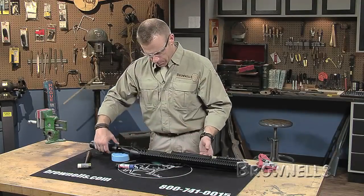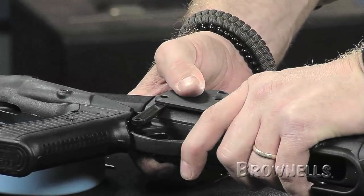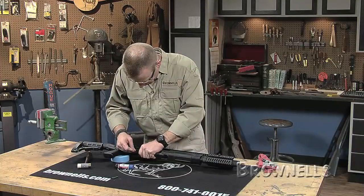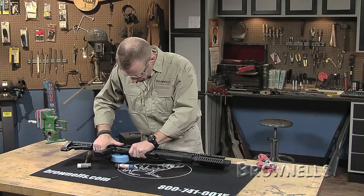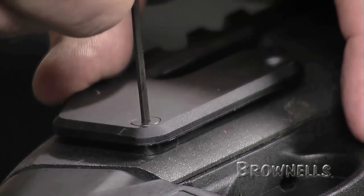Flip over your shotgun, insert and align the other plastic spacer, and then by placing one of the bench blocks under the new pin, push down on the receiver to drive the pin home. Repeat this for the second pin and finish up by tightening down all 4 small screws into the replacement receiver pins. By the way, keep your original receiver pins in a safe place so you can reinstall them later.